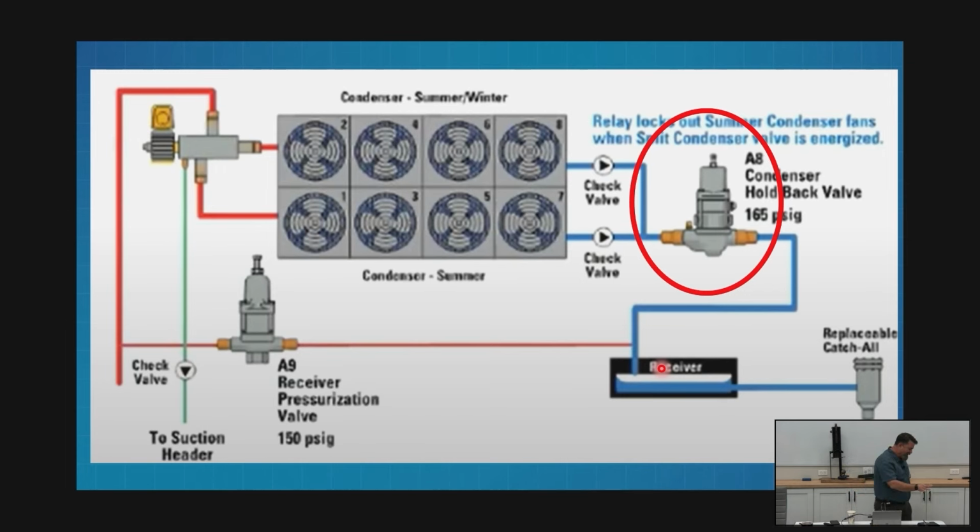So what's happened is I packed all of my liquid into my condenser, all of it, and I don't have any for my cases anymore. I've got a stream running through my sight glass. I've got some liquid going to my TXVs, but not nearly enough. They're all starving, so my cases all start running warm, and that launches my alarm.